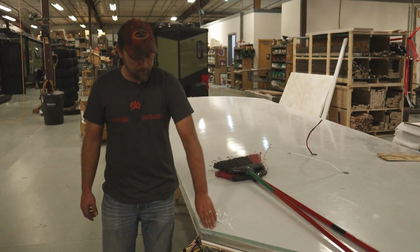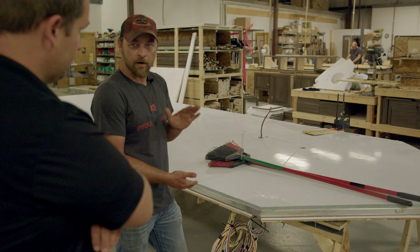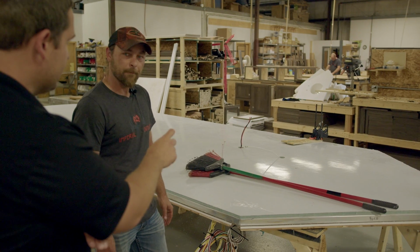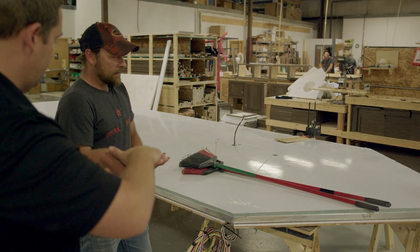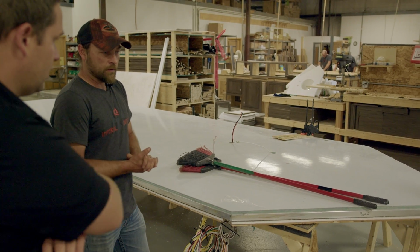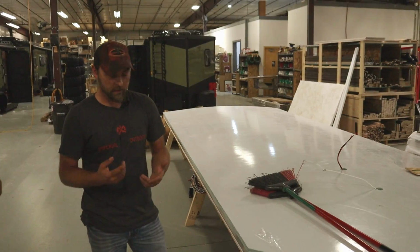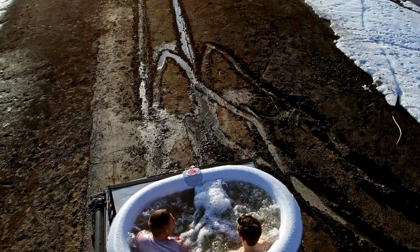Here we're using the same material that we use in the floor. It's the PET core. It's got the woven fiberglass top and bottom skin. It's one piece. It's woven into it, so it's not laminated together. It's extruded, and if it's not laminated, it can't delaminate. Yeah, that makes sense. And again, it's waterproof, extremely strong, much stronger than wood, much lighter than wood. We know that and believe that, after putting a 2,000-pound hot tub on the roof.